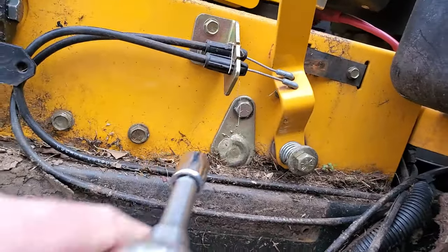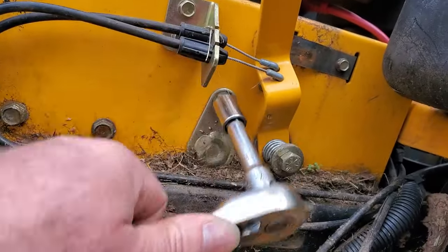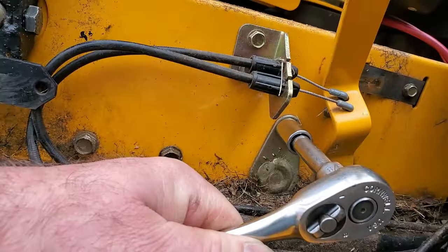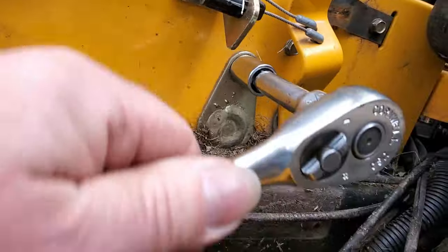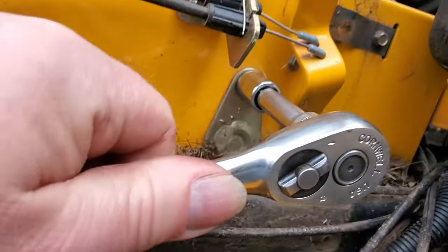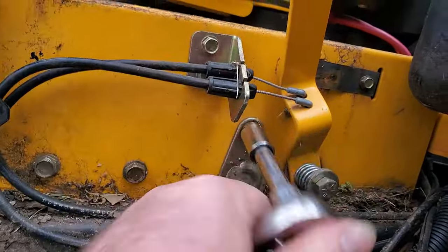Okay, here we're working on a Cub Cadet zero turn. I've done other videos on this already. We're going to replace a broken bell crank. That's what the part's called. It's for the steering. It converts the forward and backward motion of your handles to an up and down motion